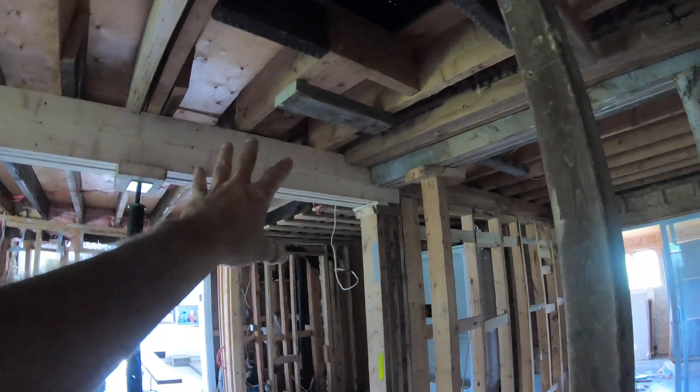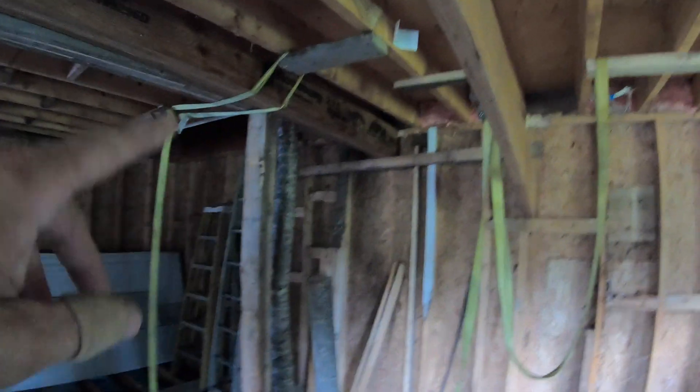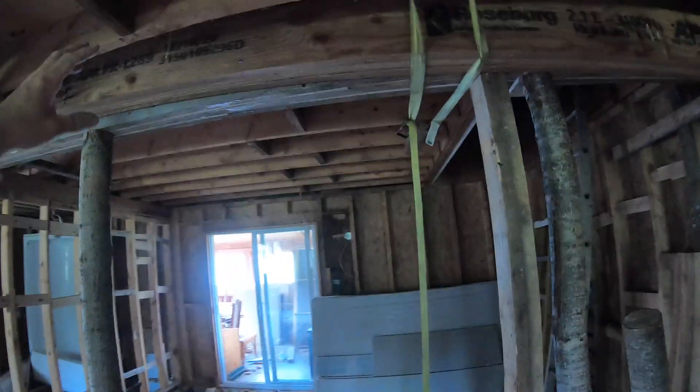Today I'm building the beams that will hold the two supporting walls on the second floor and the staircase head. I'll show you how I'm making the beams — I have one done already. As you can see, it's sitting on the beam and hanging on the straps as well as on a two-by-four on the wall, with no tension on it at the moment. There's a gap between the beam and the floor because the glue is still curing.